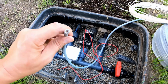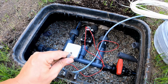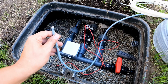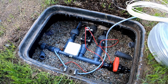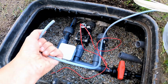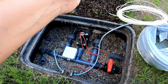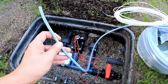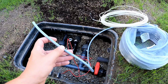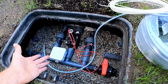If I need more cables later on because I've installed more valves or am using other systems, there's enough space in the empty conduits to thread additional cables through. Since the cable is relatively soft, it's quite difficult to push it into the empty conduit. If you have a straight run without any curves or bends, you might be able to push the cable through for 3 to 5 meters. Otherwise it won't work anymore. In that case, a cable puller is helpful.